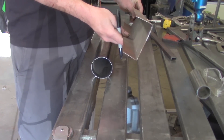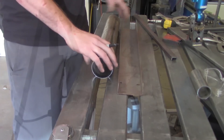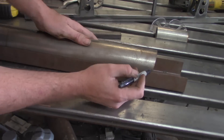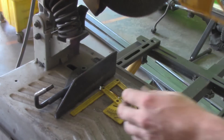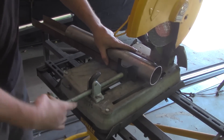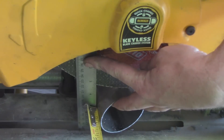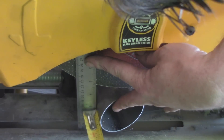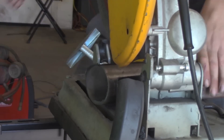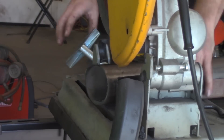This is a handy dandy tool. It's basically a piece of sheet metal where the bottom section is the diameter of the tube at three inches and the sides go up to an inch and a half. So I can just stick the tube inside of there, mark it down on both sides evenly, and now we have clocking references. Setting up the chop saw is pretty much the exact same as setting up the band saw. I'll use the angle finder, set it up at nine degrees, and I'm going to make the exact same cuts. It's a little bit difficult to get the clocking reference, so basically all we're going to do is take a straight edge to the blade, measure the difference with the pie cut sticking out there, and then slice it. As soon as you're done with that, flip it over using the tool as a guide and reference. Measure it out. Cut it again.